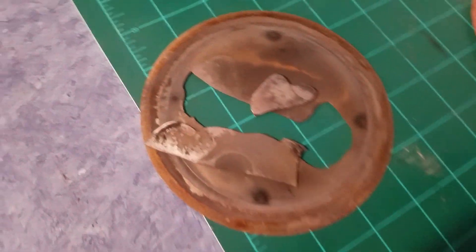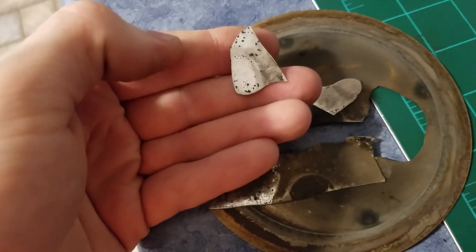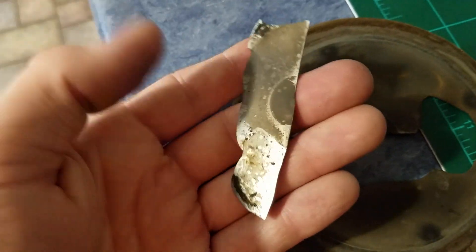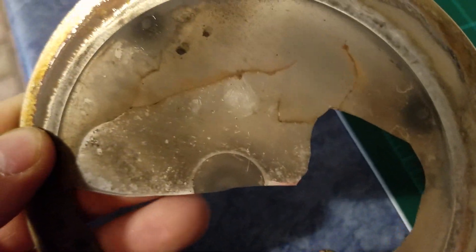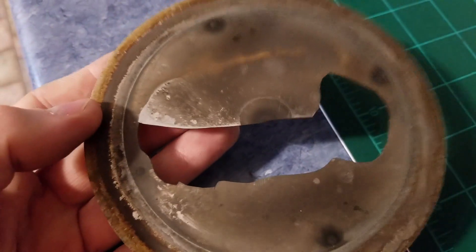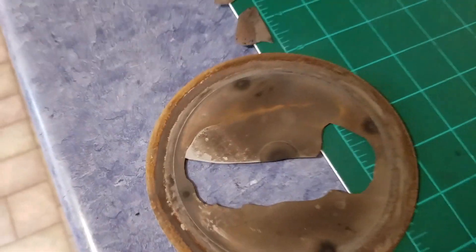That other nozzle is significantly worn down compared to this one, which is still in really good shape. Part of the reason is that bell had a broken diaphragm — and it was not a front diaphragm, it was a back diaphragm, thank God. A broken front diaphragm can be a real nozzle killer. I've seen a couple nozzles that were really bitten into from broken diaphragms. So this is the rear diaphragm out of the number three bell — I could hear the parts rattling around in there.